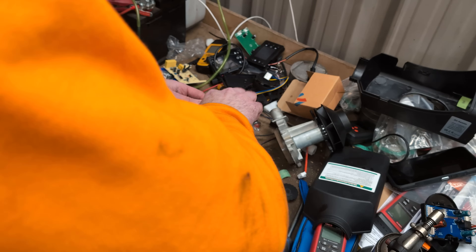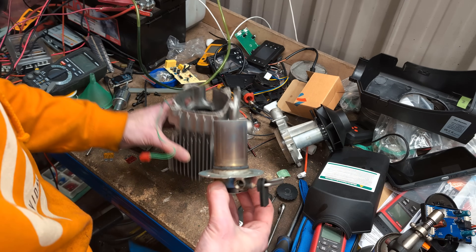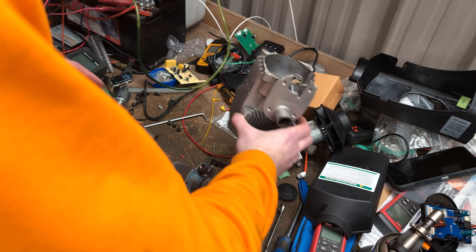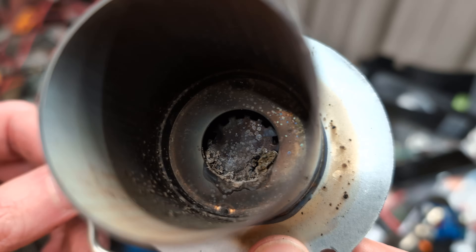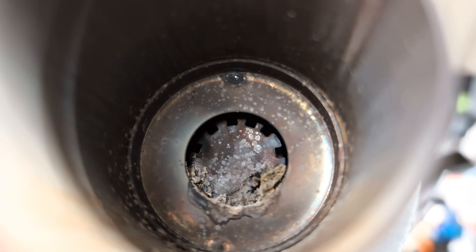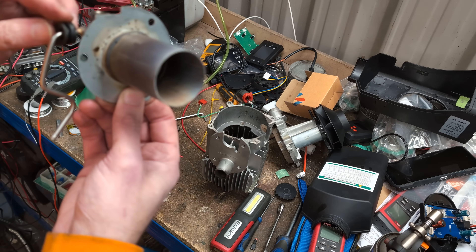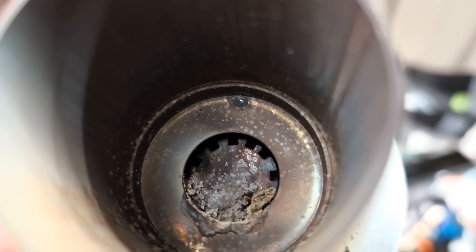I've got all the screws out, let's extract the burn chamber. So inside — it's a bit more ashy, not as wet looking, not as black carbon but a little bit more white, that concrete-looking texture. As for the burn chamber itself, it's still clogged. It was still running when it stopped, and it's still got a build-up of deposit on the inside — not as much on the outer rim, but there's a bit of spattering as well, though that might just be from welding. I don't know how much longer it would have actually run before it stopped.